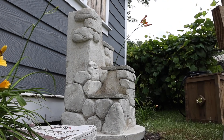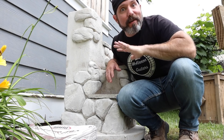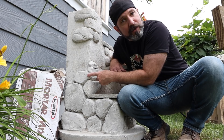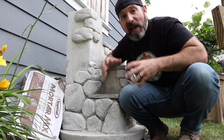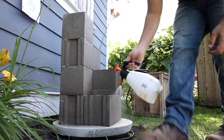Here's the hard part about this project - the sculpting - but it doesn't have to be. You can get as artsy-fartsy with this as you want, or not at all, or just have somebody else do it. I did it with the RapidSet mortar mix. If you want more detail, watch my video on how to parge with RapidSet mortar mix. The two biggest words of advice: do not do this on a hot day and do not do this in direct sunlight - I waited for the sun to be on the other side of the shed. Have a plan or a drawing so you know where you're going. Start by wetting the block down nice and damp to give the mortar something to grab onto and to give the product more moisture - that's very important.